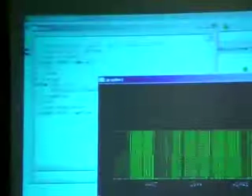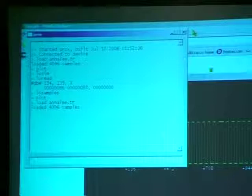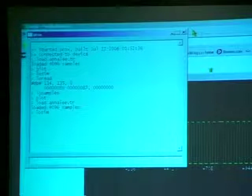This is another representation of the exact same trace that I just read. And then I can put this device, this reader that I'm using, in a different mode in which it replays an ID. So it's behaving like a tag instead of behaving like a reader. Low sim, low frequency simulate. So now I'll take the VeriChip reader. Once again, it takes a few moments to power up.